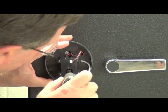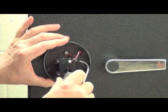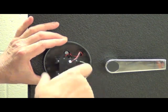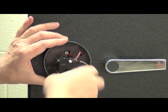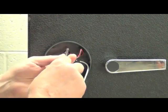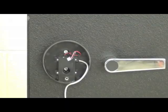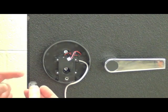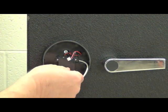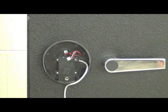The bottom screw goes through the hole provided where the battery compartment will be once installed. Once we begin to snug the screws down, we'll line up the keypad so it looks nice and straight on the safe door, then tighten the screws. Now we see that our keypad base is in place and we're ready to mount the number pad. Before doing that, in our accessory package there's a small circular disk with two standoffs — press them into the opening used for the bottom keypad base mounting screw. It's now securely in place and will support the back of the number pad once installed.